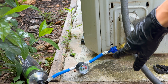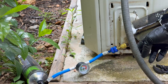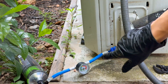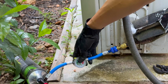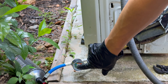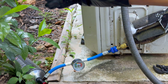We're outside here and as you can see, we already have it connected. If you go outside and see frost on the bigger line, as you can see right here, that's also a telltale sign of not enough refrigerant. I've opened it up and connected it, and if you look closely, the arrow is down here — it really should be up in the blue area.